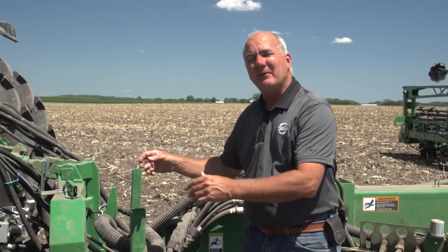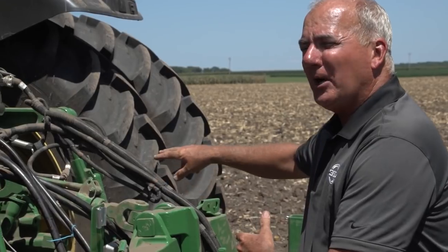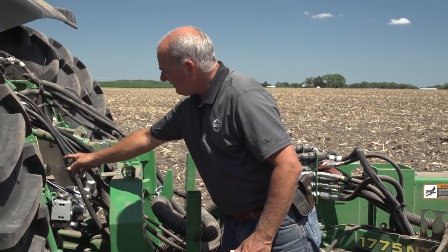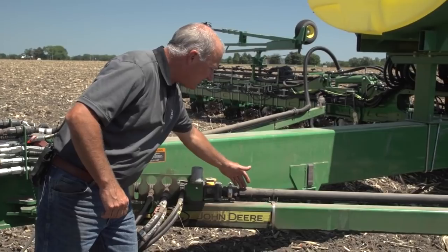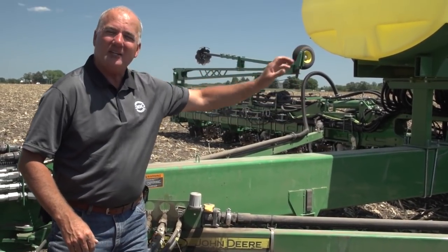At 360, we mounted a hydraulic high-pro pump, feeding it with an inlet of 2 inches, out pressure line with 1.5 inches, with a frame mounting system right to the casting of the tractor for easy mounting. Then the pressure comes right down the 1.5 inch solid tubing that's mounted very carefully to the wishbone and right back into your manifold system.